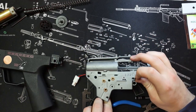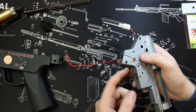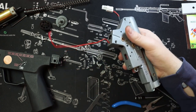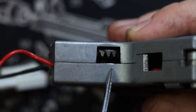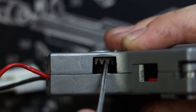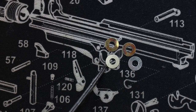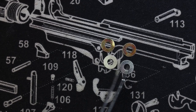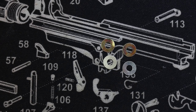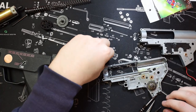Initially you put your gear into your gearbox casing and hand-hold it closed with no screws in, just to see if there's much play in the gear — and there is. You can see this gear has tons of play, probably two millimeters. The silver shims I have here are 0.2mm thick and the brass-looking ones are 0.1mm thick. We're going to start off using the 0.2s because there's a lot of play, work our way up, and then once we get close we'll switch out 0.2s for pairs of 0.1s to fine-tune alignment. We'll start with one shim on each side of the gear.